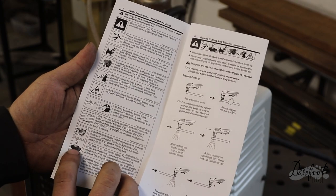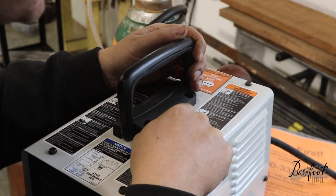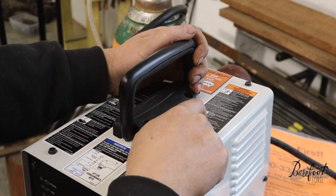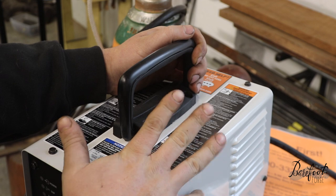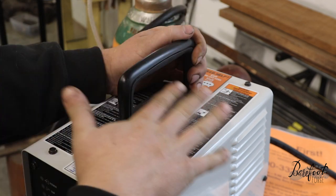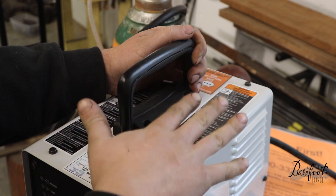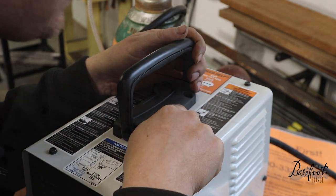Do not cut directly through your hands with a plasma cutter. Sparks, watch for fire, keep an extinguisher nearby. Absolutely, and whenever you do anything with plasma or welding, you wanna have a fire watch. So basically that just means when you're done with what you're doing, crack a beverage and stick around for the length of time it takes you to drink that beverage. Just make sure something isn't smoldering and catches on fire later.